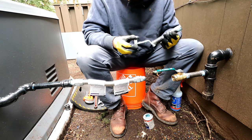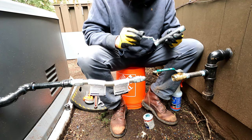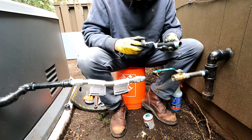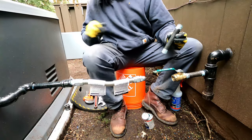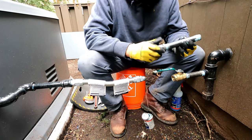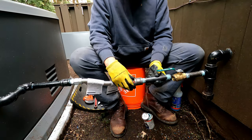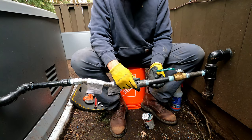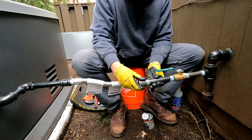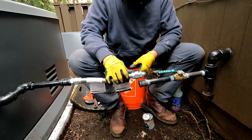I'm gonna take a little of the brush because I will be leak searching this once I got it done. You always want to make sure you have no leaks — just to protect yourself. See there's no union on this gas line — at least not an official black pipe union. It's because of this, as you can see it's a little too long right now, but I'm fine with that.